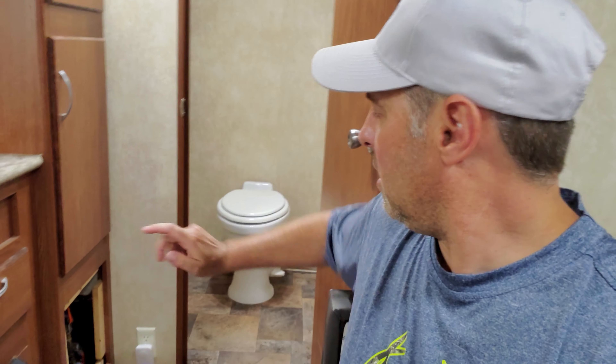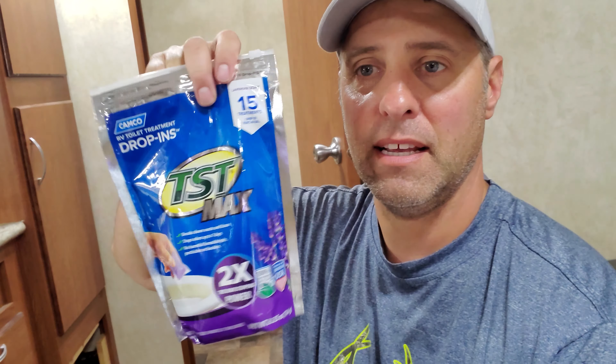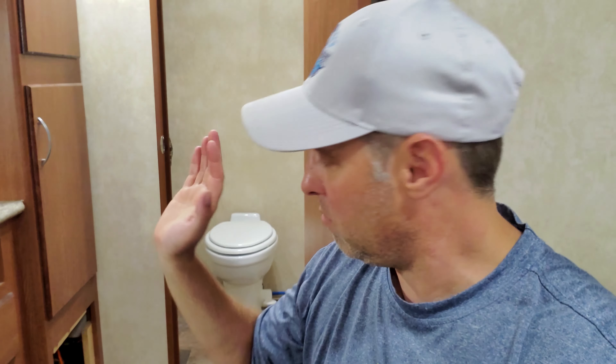The other thing is I just bought this camper used and I don't think they fully cleaned out the tanks — it kind of stinks back there. They had these deodorizer things sitting in there, and I gave this tip on another video, but these things do not work. If you want your bathroom smelling good, look up the Geo method. There are several different recipes — I use about a cup of Dawn dish soap, a cup of bleach, and a few capfuls of Calgon water softener, mixed in some water, put it down the toilet, and it works great.